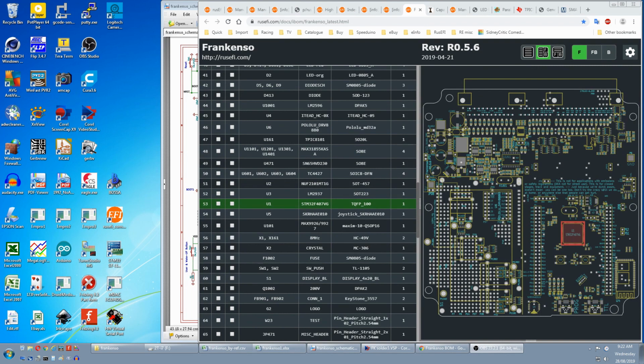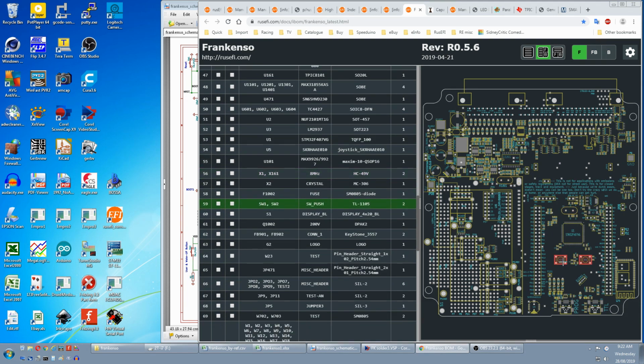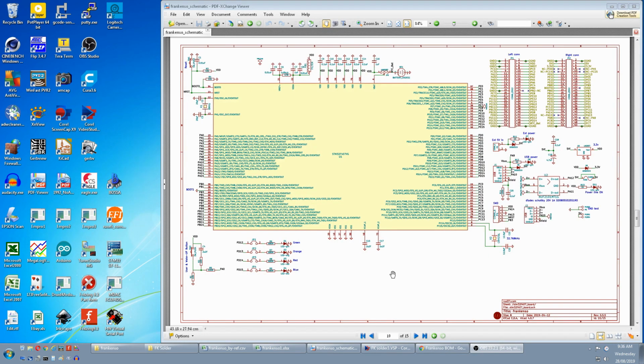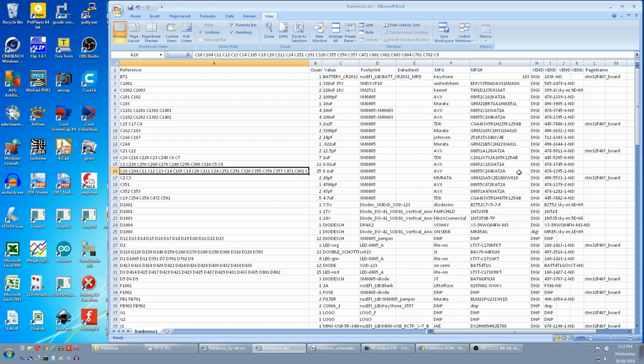The first option that's not catered for is probably the onboard STM32, so this circuit could probably be removed. But even then it's not clear, because the kit has the crystal and a switch. These might be thrown in because they cost nearly nothing to supply, just in case you need the STM board. I would assume everything on page 10 of the schematic can be removed if you're using a plugged-in discovery board, and there has been steps taken in the Frankenso.csv BOM to tell you which parts are part of the STM board, but if some of those parts are in a group, like this 0.1 microfarad, there's no warning.